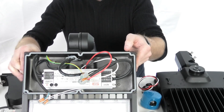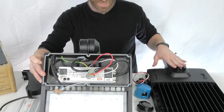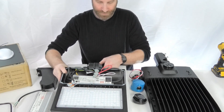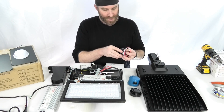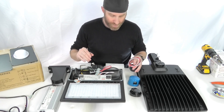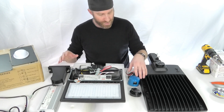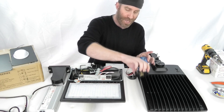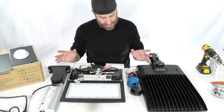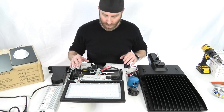That slides through to the top of the light, which you can see over here on the 300-watt version. The receptacle comes in and you've got your lines going in if you were to bypass that. Pretty simple job getting the bypass. Photocells and bypass caps are optional for these. Whether you want to go with the photocell or skip it — you can bypass it internally — but why go through that when you've got a bypass cap? Keep it real easy.